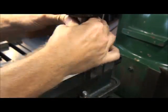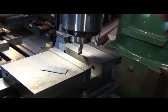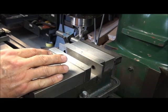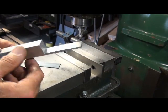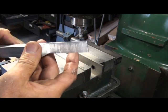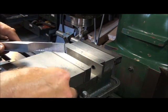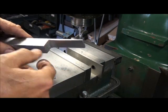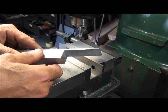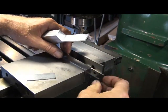You can see the edge of the cutter is now lined up with the front of the parallel. Next thing you want to do is cut yourself a piece of bar stock — three quarters thick in this case, because I'm going to be machining the part out of it just like this. You have to start out with a wide piece because you need enough meat on it to clear the cutter when you machine it. We're going to be cutting the part out of it just like this. Grab yourself a piece of bar stock, saw it out — sawing extra material out is always faster than milling it. We could mill this, but it would take a lot longer. Saw it out and set it in your vise on a pair of parallels.